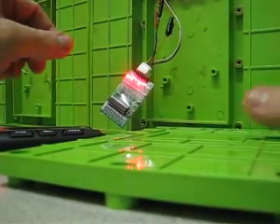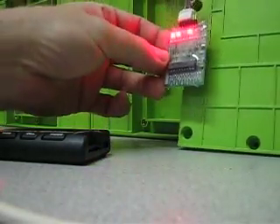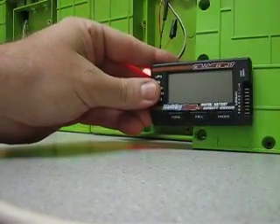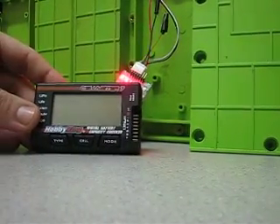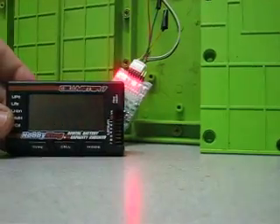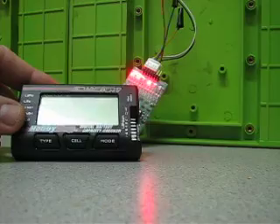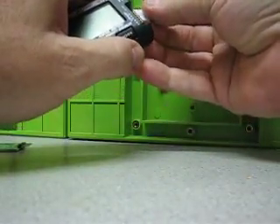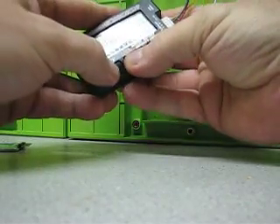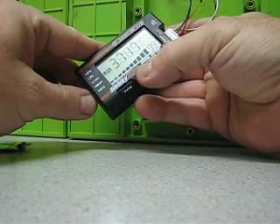What I plan on doing is, of course, putting the covers on, having these come through. We mounted out here. I originally wanted to use these, but they don't constantly balance like these other ones I have. But I still like this because you can check the cells individually with this, and you know exactly what's going on as far as voltage — it shows each cell and where you're at.